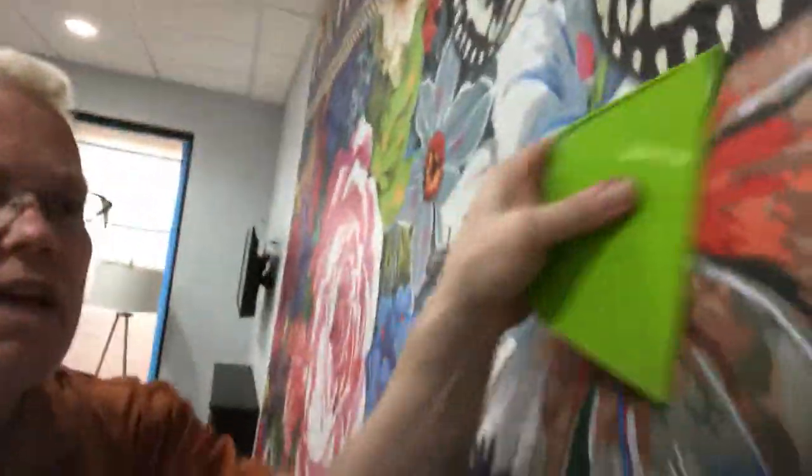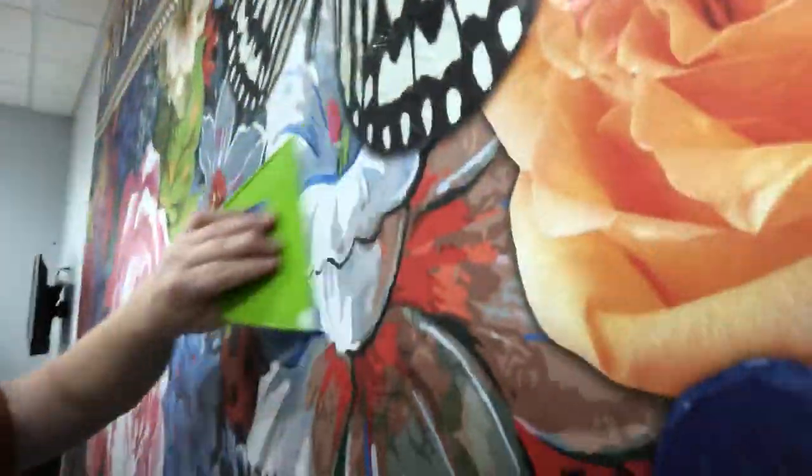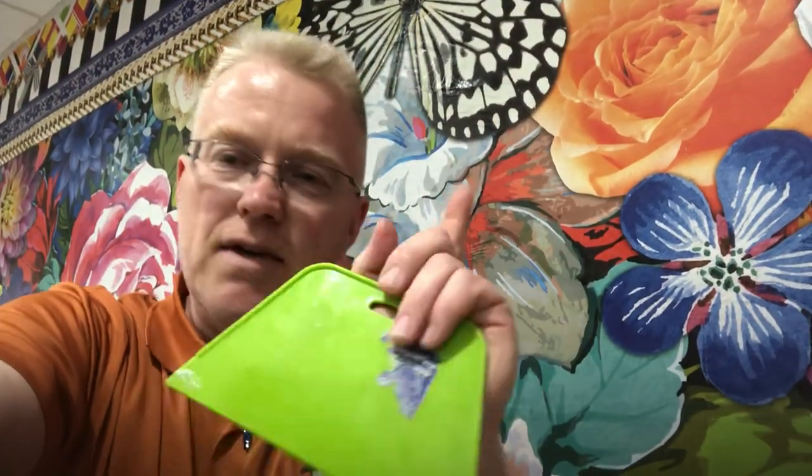I just want to show you — I'm almost done here. I have to work out these wrinkles, but you can see I've dispersed the glue pretty nicely. Pushing these wrinkles away, pulling them down, getting them away from the area — look at how nicely they're laying down. I'm just going to keep working them out. You have to work quickly though, because once your wallpaper gets stuck you can't move around it and it forms an air pocket. That's how we do it. This is Spencer Colgan from Spencer Colgan's Wallpaper — please click like and subscribe to my channel, and I'll see you on the next one. Thank you.